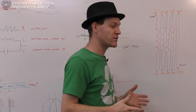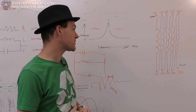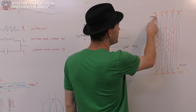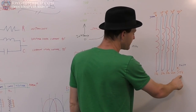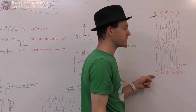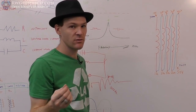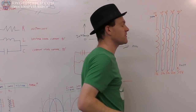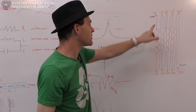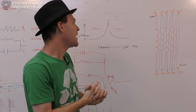You can do this with any coil, but most of the self-resonant frequencies of this ring test on generic standard coils are going to be pretty high because they don't have very much internal capacitance. You might ask me why it adds a bunch of capacitance. This is a common standard way of thinking: if you've got 0 volts here and 10 volts here, and you split it across the windings, you have equal resistances making up the inductors. Between the 0 volts and the 10 volts, you have the insulation of the wire as your dielectric. Because you have a high potential difference between the two, you basically have a capacitor. Then you add another one and another one, and by the time you bunch these five wires together, you have 0 to 40 volts. Here you've got 10 to 50 volts right up against each other, and that creates the capacitive action inside this coil.